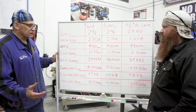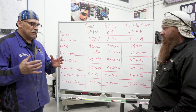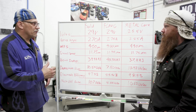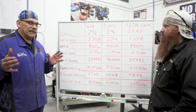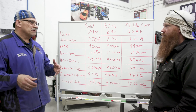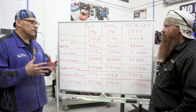Another option people are doing is using a flux core wire approved for higher argon content — some flux core wires can run at 85% argon. In a large shop, you could have a machine set up for flux core, run your metal core or solid wire for flats and horizontals, then swap to flux core for verticals. Or dedicate one or two machines to flux core and do all out-of-position with those. It's the best of both worlds.